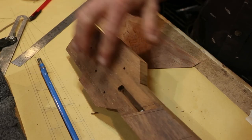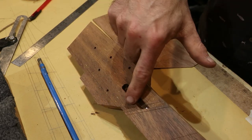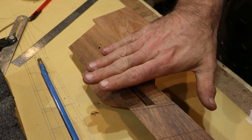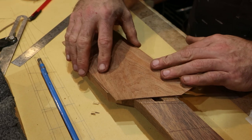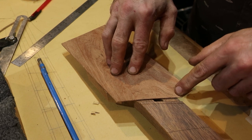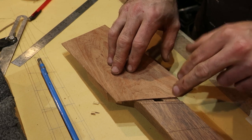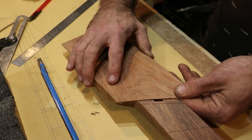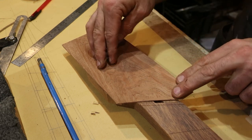Okay, so I have taken enough thickness off there to round out that side, and I've actually just had to chisel. I didn't want to take off too much off here and wind up with the thing on a weird angle, so then I just chiseled out a little bit on that side, and now I've got a plate that will sit not quite perfectly flat, but it's only got to glue down that much, and I can probably use a heat gun to bend that bit of wood so that it'll just want to sit there and stay exactly where I put it. And then of course with a nut to fill that gap, it should look like a pretty seamless transition.